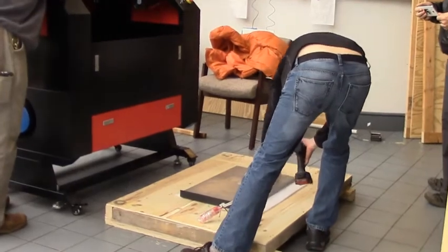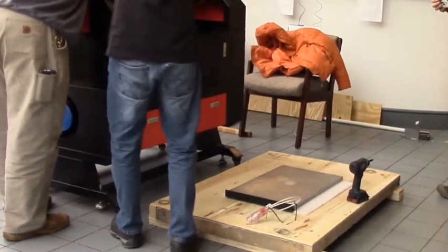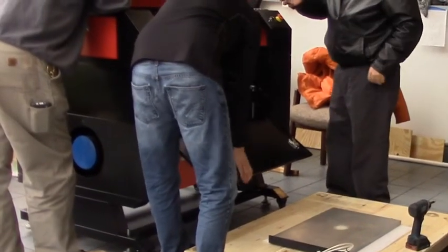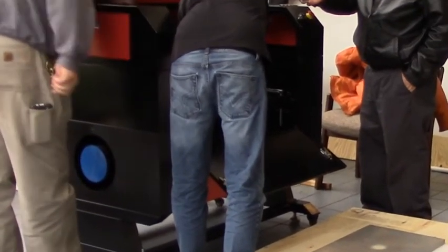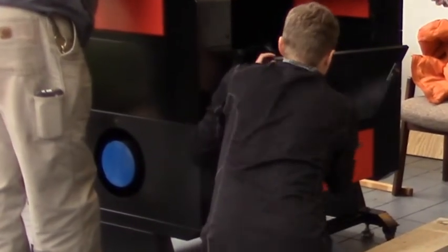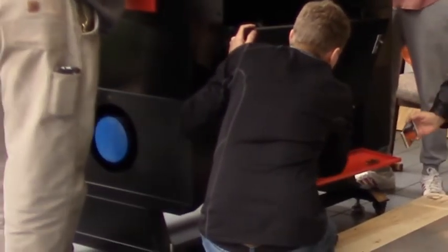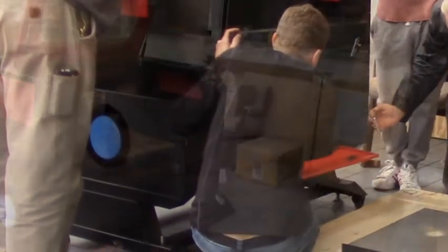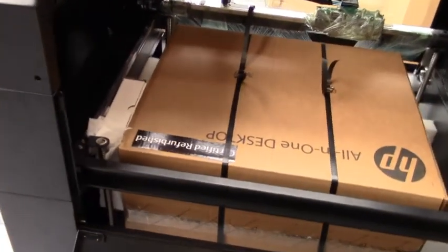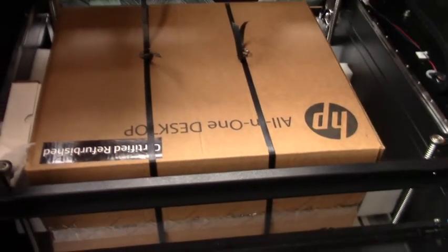In addition to that video, all that really remains is unwrapping your yoke and getting all the cling wrap off. You can see we've lowered the bed all the way to the bottom — there's some foam underneath just to dampen vibration. You can manually raise it, but do this slowly because if it goes too fast it'll generate electricity back into the motor driver and it'll lock up temporarily.